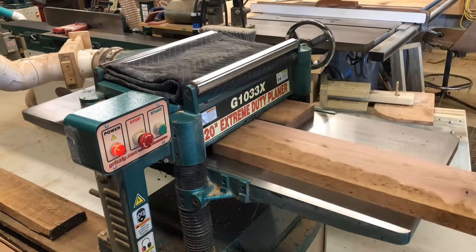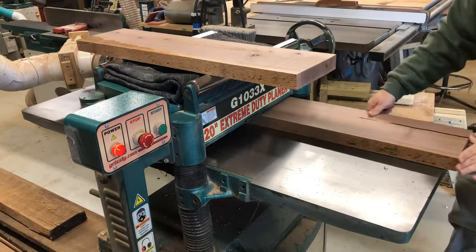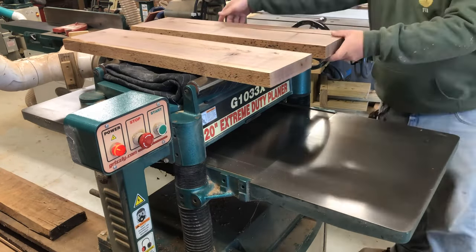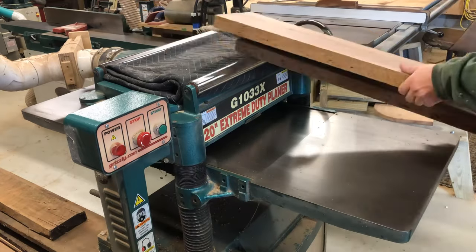If I remember right, they're going to be about 1.5 inches by 1.5 inches by 25 inches long overall. And then since the top is going to be 1 inch thick, that'll place the final height at 26 inches. And that's a pretty good height for a nightstand. It's not too tall and it's not too short.